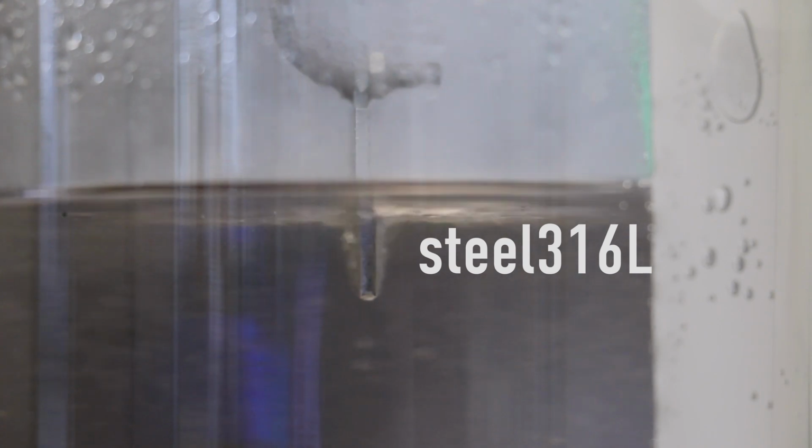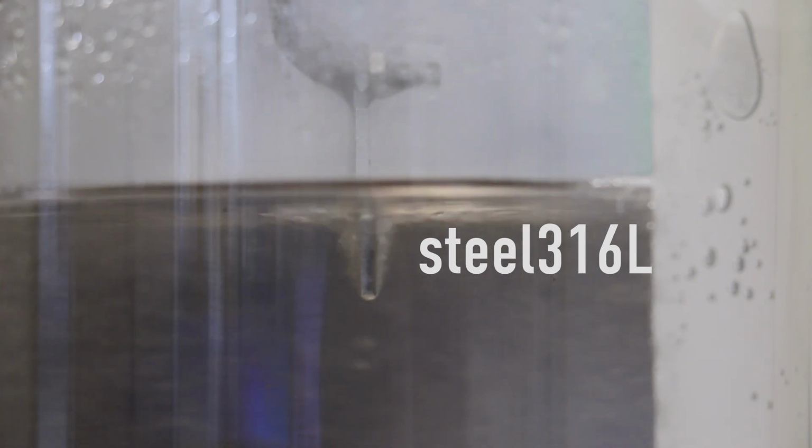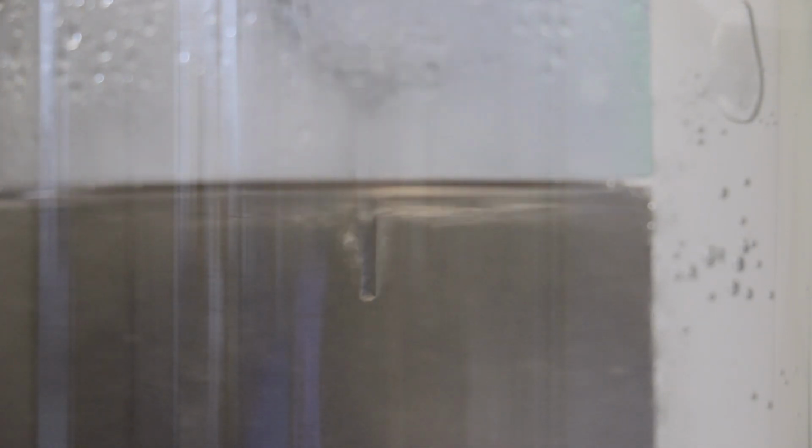So now I will show you a short experiment. Our ongoing research is focused on investigation of the plasma gas layer that is formed around anodes within the process. And to investigate this plasma gas layer with optical methods, you need to keep the electrolyte clean and transparent. For this purpose, we investigate a new electrolyte with another chemical component. So here you can see an example of the PEP process.